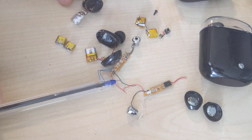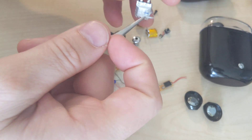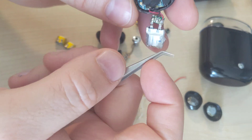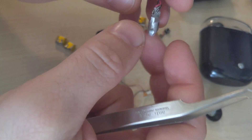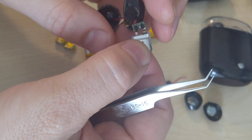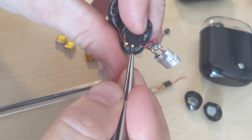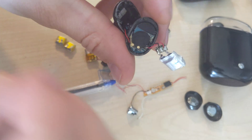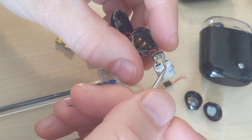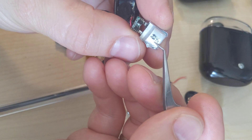My idea was to just replace these small batteries and try whether it's working or not. I believe maybe one of these is the charging IC over here. It should be, because five volts is written right here — it's able to take five volts in and provide 4.2 to 4.3 volts maximum for a lithium cell to be charged. And here it says 3.7 volts.